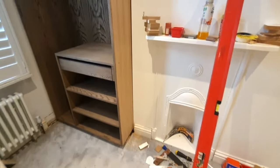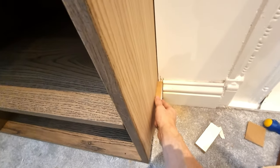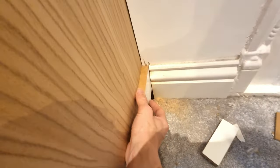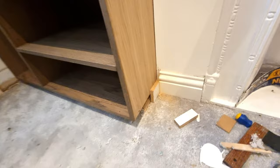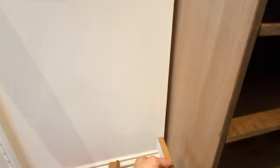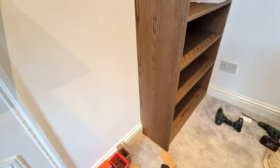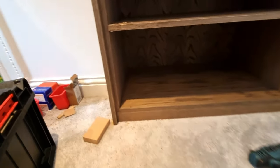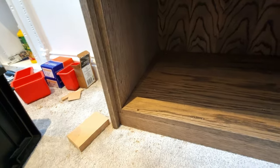Just imagine this is our side panel going on here — we've cut back that skirting. It's a bit of a gap there, but 19 mil oak veneer is bigger than MDF so it's nice and tight when the oak goes in. That cheek should run in nicely giving us a nice joint. We've done the same to that side — it's like 19 to 20 mil at the bottom, near enough touching at the top. We create a 22 mil overhang of the panel to allow for the 19 mil door and a 3 mil gap behind.